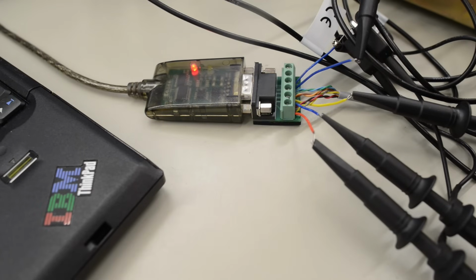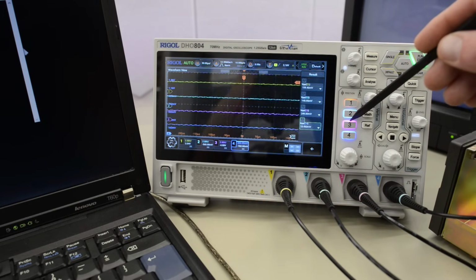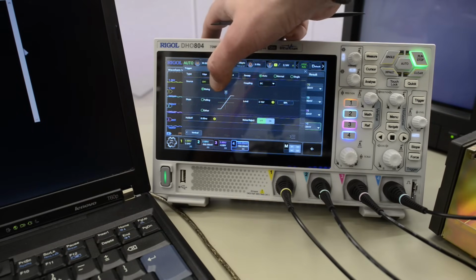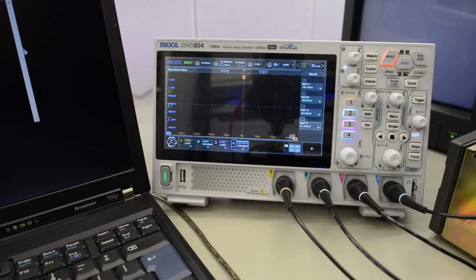Okay, I did some thinking. What if the server is waiting for a signal from the NABU? Some sort of a handshake. So let's probe the driver in the NABU. Okay, channel 4 here is plus and channel 3 is minus. So let's change the trigger to channel 4. Take a snap and power on the NABU. Okay, we either have nothing or it's just not triggering.